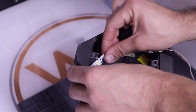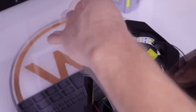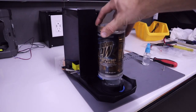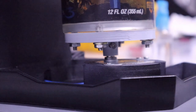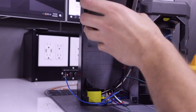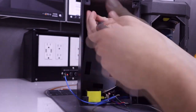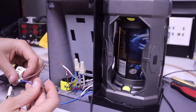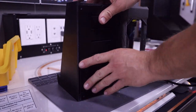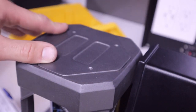Now onto my favorite part: putting all the pieces together and connecting all the wires. The way it works is when I place my phone on the stand, it sends power to the motor to spin the can and kicks on the lights. Once the phone's on the stand, it also gets charged by a wireless charger mounted behind it on the plastic. I was concerned there would be too much of a gap between the phone and the charger with that plastic, but to my surprise it even charged the phone with my case on.